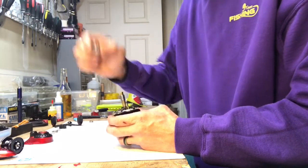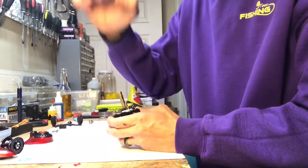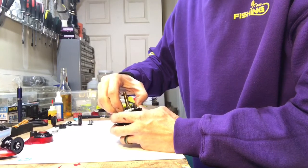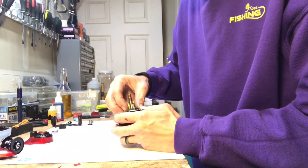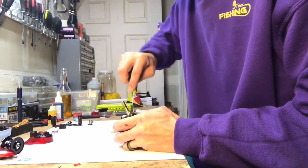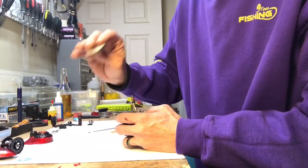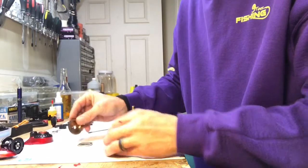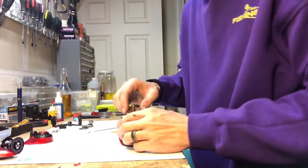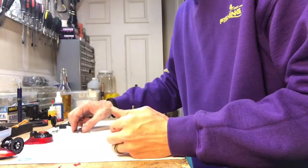So you got your bearing system there, little bearing collar, little rubber washer. You got your big main gear here, which will come off as soon as you... Sometimes you got to take this washer out first, sometimes you don't. This one appears to be a little bit more stuck on there. There we go. So there's your main bearing portion. Inside of here there's a washer, a couple of little washers, so just pull those off and down. Another little gasket washer, another gear.